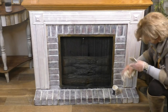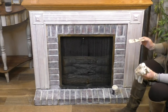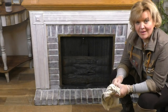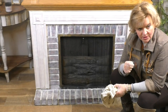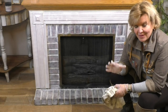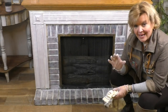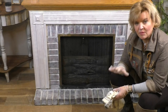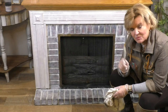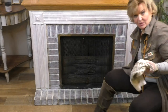Mary Beth wants to know what I think about whitewashing over kitchen cabinets — straight over the oak. That sounds good in theory. Will it look good in reality? That depends on how good you are with doing this. We did some in our old office building — we did a washed finish but painted them first; they were flat modern doors. I can't imagine what it would look like with raised panel oak doors — you might end up with a mess. But you might be great at it. Try it on the interior of a door first so you can see if you like that look before you get going.